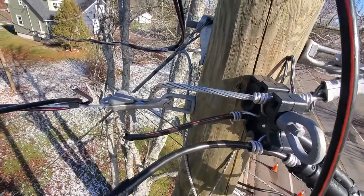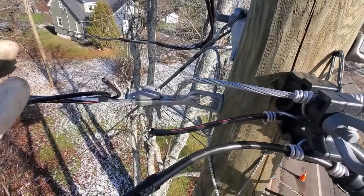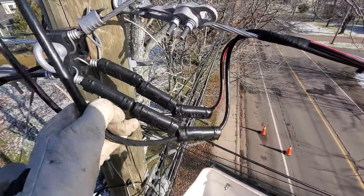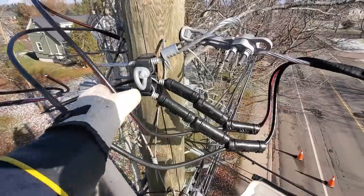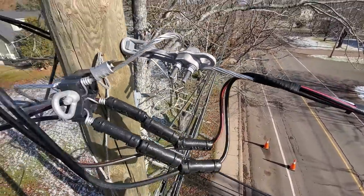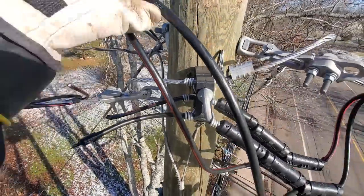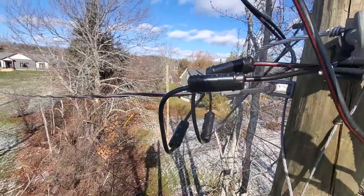Which again, not a big deal — does create more work. The less connections on a wire, technically the better. Same idea: if this guy gets cut off, that's a bit extreme for slack, but there would be enough room to reconnect them. So when you're framing up poles guys, make sure you leave a little bit of extra wire, make things neat. That's a little bit extreme, especially on that end there.